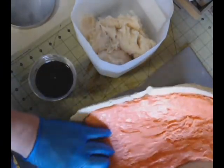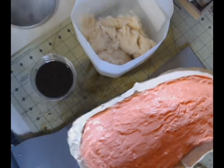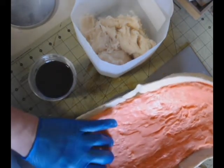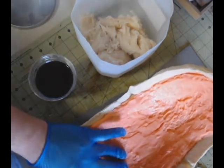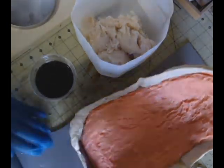So now we're going to go back to making our inside mother mold half. And what I'm doing here is I'm using some plastiline at the bottom to make a sort of dam, so that the mold doesn't close completely. I want to keep a little bit open there for my pour spout.